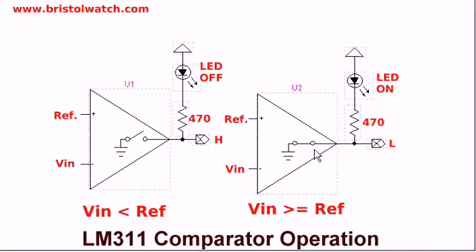The internal switch in the LM311 will go low. It will drop the output pin, which is pin 7, low. The LED will come on, and the Arduino will detect that low logic level and stop the count. Just like the internal Arduino ADC, it will know what voltage approximately got me the low and a match.